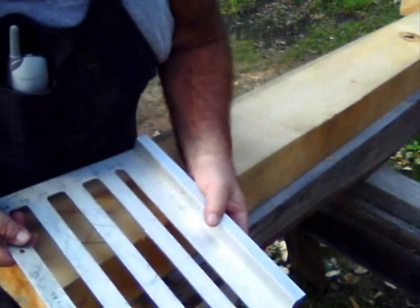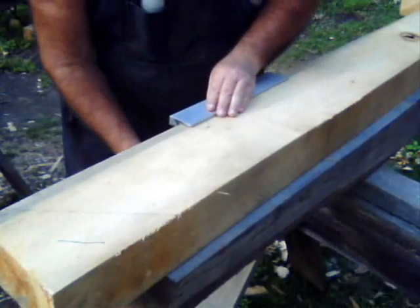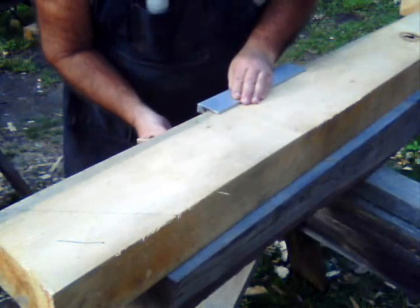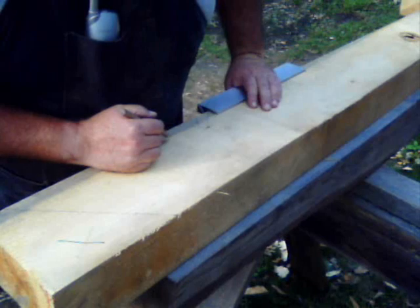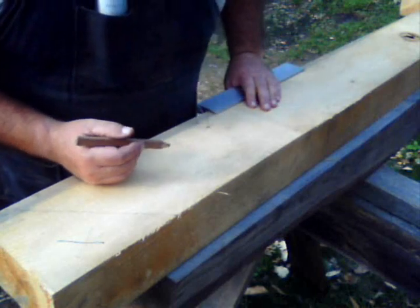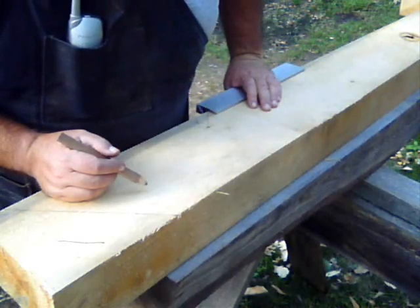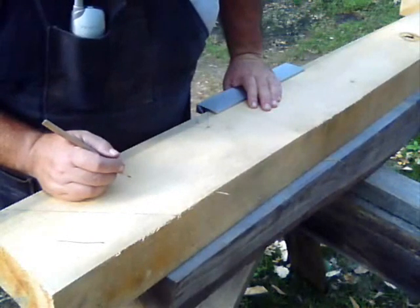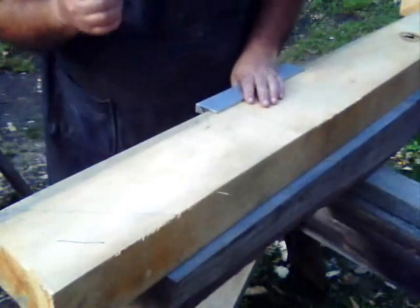Using the Big Al, I can draw lines across the bottom of the rafter, which would project the lines to the other side of the timber. Drawing a vertical line down the side of a timber is often called dropping a line. So if you read in a book where the author says drop a line, that's what it means — draw vertically down the side like you are going to drop your pencil.